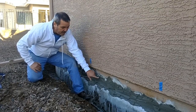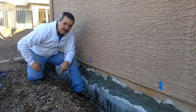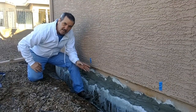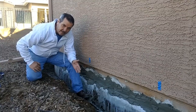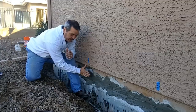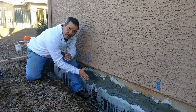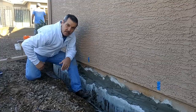What we've done here is we've put our exterior patch on. This is a 6,000 PSI patch material, and we're allowing this to set up and dry before we bring it out another lift. When we get done with this, it's going to be a smooth, paintable surface that we're going to waterproof with two coats of waterproofing, and then one coat of exterior house paint.